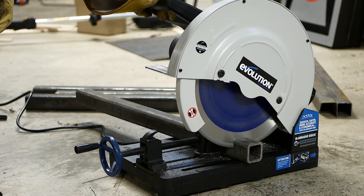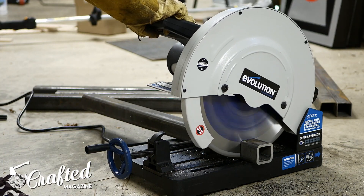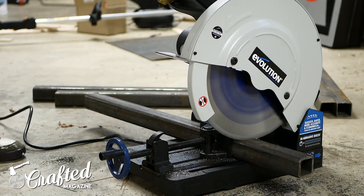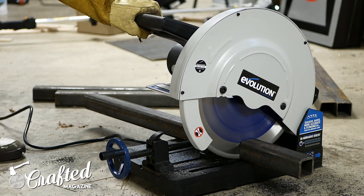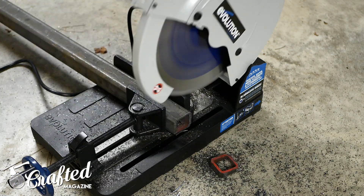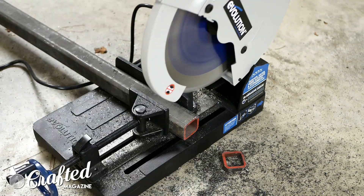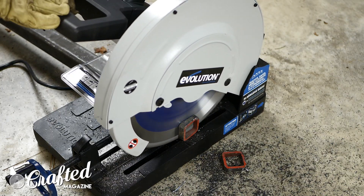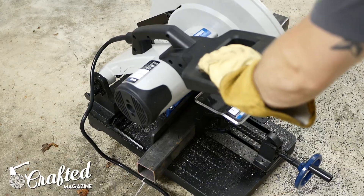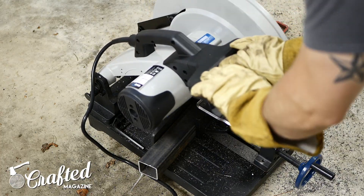The first step in building the legs was cutting the metal pieces down to size. I used quarter inch thick, two inch by two inch square tubing that I found at my local scrap yard for the legs. This was probably complete overkill for a desktop made of plywood, but that's what I could find and I think it looks really cool. The finished legs actually weigh about 40 pounds each. The long pieces were roughly 27 inches with a five degree angle cut on both ends in parallel, and the center connecting pieces were roughly 12 inches long with the angles cut in opposing directions, giving the finished legs a slight splay.